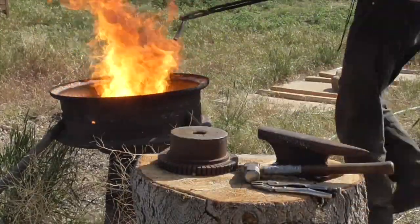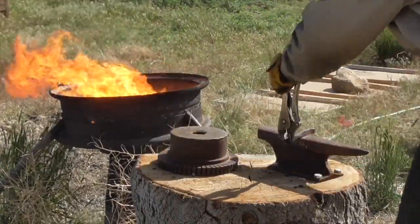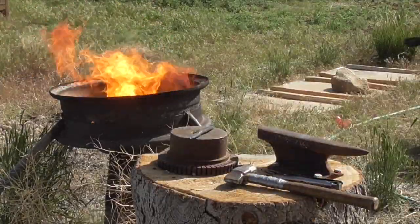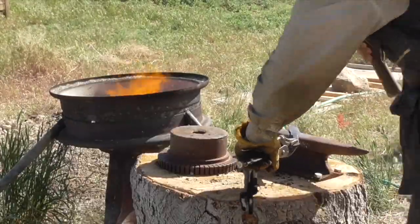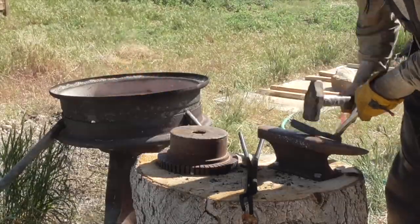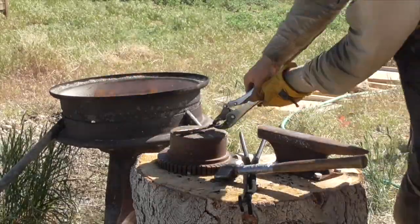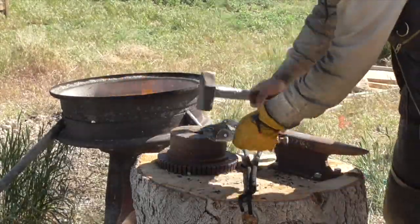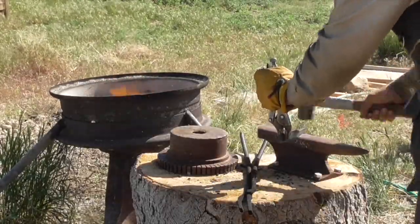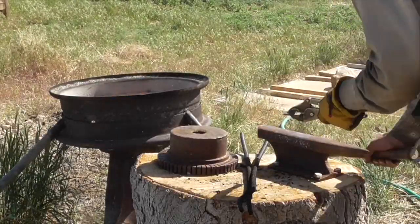With some types of blade steel, this would present a problem, because the heat of molten aluminum would re-anneal the blade, or at least portions of it, during the casting process, and yet it could not be re-hardened without also remelting the aluminum. However, Type D2 tool steel is extremely difficult to anneal. So I think that if I start with a properly hardened D2 blade, I will probably be able to cast the hilt without softening the blade too much.